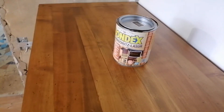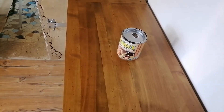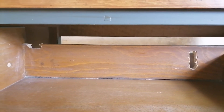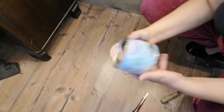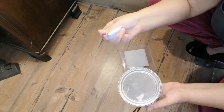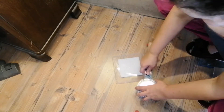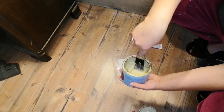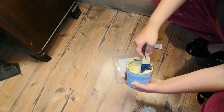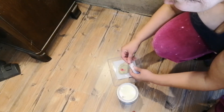After a couple of other tries, I finally used the Bondex stain and the result is gorgeous. I also noticed this table was likely used as a TV stand earlier — it had some holes inside, so I covered them with tape and used some filler to close those holes. The filler I'm using is called Bondo — it can be used for cars too, it's a heavy-duty filler. It has two parts: the filler and a hardening cream. Mix only a small amount because this product hardens very fast — in about 15 minutes maximum you won't be able to work with it anymore, so you have to move very quickly.